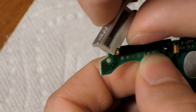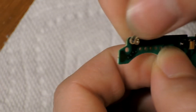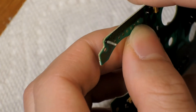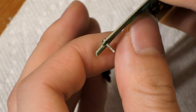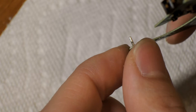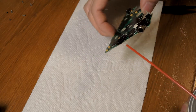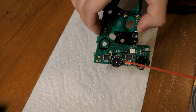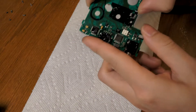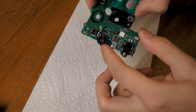Now if you have a bad connection, you might want to remove the battery contact and clean that pin with some rubbing alcohol, because there might be some corrosion. In my case, you can see there's some corrosion there — that dark spot. So once you do that, it's time to put the board back in, but before you do that, spray the volume knob with some contact cleaner.